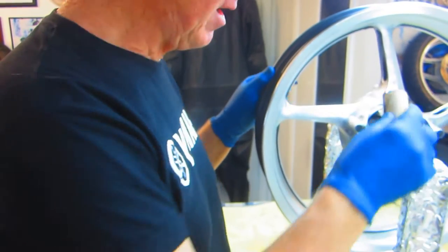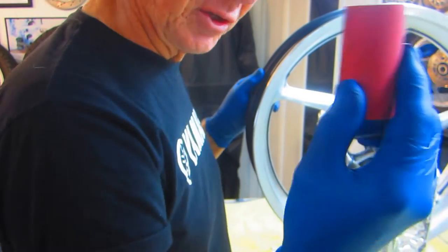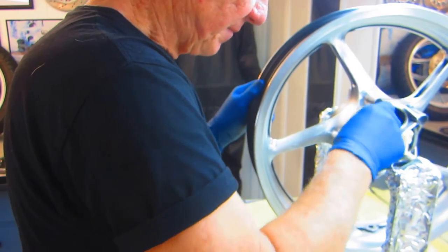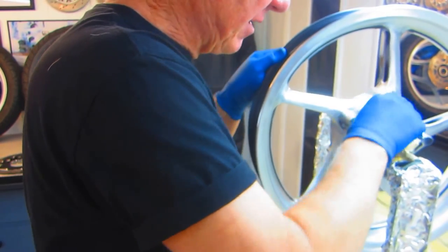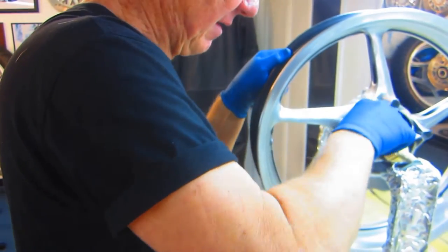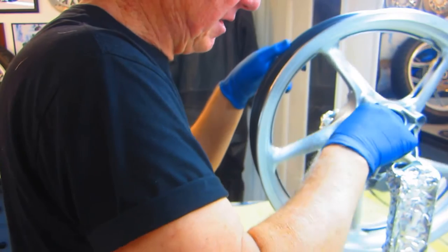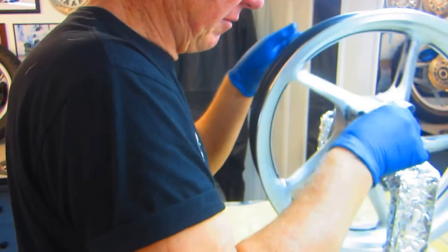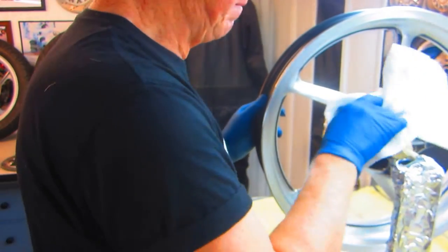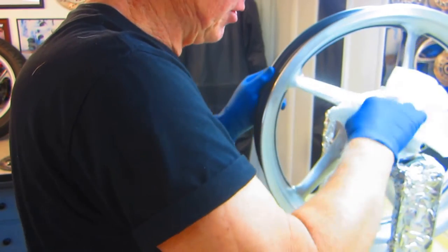Every time you can find a tool you can use for a specific size — if you need a little bigger diameter, you move to the next roll. Especially on the areas you're really going to see, the hand prep just before you prime has another advantage: if you do this prep work and let it sit for a week, the aluminum oxidizes. So it's always best if you can do this prep and then run right outside and prime it immediately.